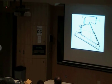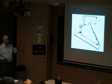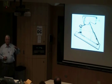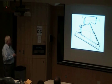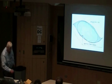You could make a contact lens and slip it on the eye, but we didn't think the customers would go that way. The old guys noticed that we got rid of the field tilt. They loved it, and they were willing to accept some coma. The young guys who never had a field tilt problem noticed the coma and said it got worse. Right? We had to fix it. And how do we do that? Well, you notice that this aperture stop gets re-imaged onto the eye. So instead of putting the contact lens on the eye, we'll put it here at the aperture stop. It's another freeform lens. It's a much smaller one.